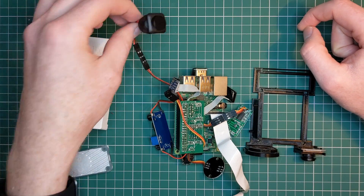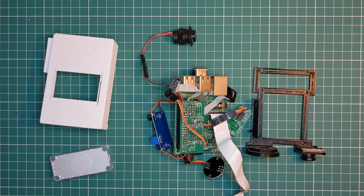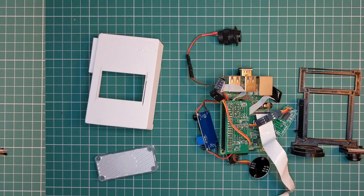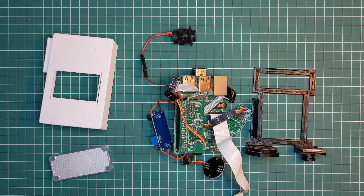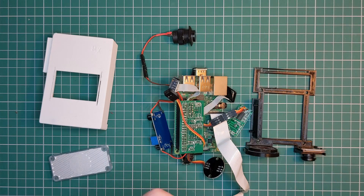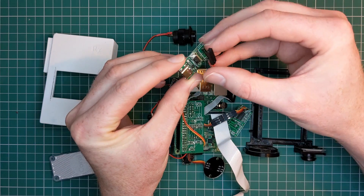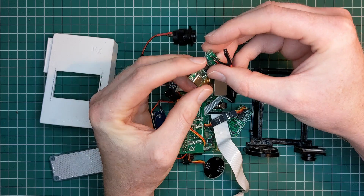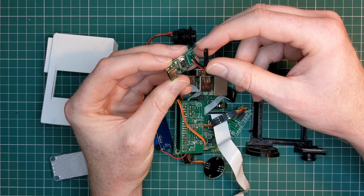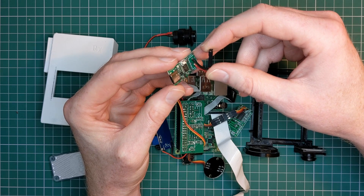I've also swapped out the tilt switch, which previously would initiate a shutdown on the Raspberry Pi if you turned the robot upside down. That turned out to be a problem because every time I was testing and it moved too much it would shut the Raspberry Pi down, so I've swapped it out for a manual push button switch. Because the connection can be removed, I can take the head off any device I'm connecting it to, swap them around, or attach it to something like a tripod mount and supply power via battery or mains. I've been using a USB-C power delivery device where you can set the voltage, and this circuit will accept anything above 5 volts, so it works with any USB power source that can supply more than 5 volts.